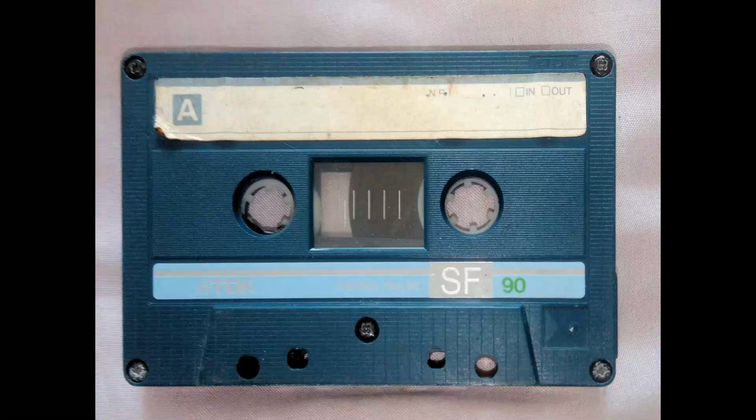The end results are this. The tape is very good. Unlike the BASF, it does actually drive into distortion, and you can get more than 0 dB out of it. And unlike the BASF, you can actually get a more reliable recording on the W-1200. We're not looking at between 6 and 10 dB down, we're only looking at 1 or 2 dB down compared to the standard ferrics and the CDing 2. So overall, very good tape. Overall, good frequency response. Overall, good hiss.